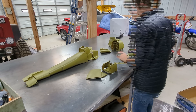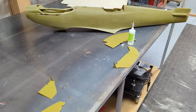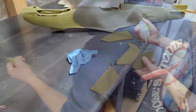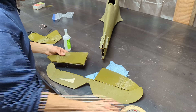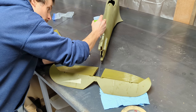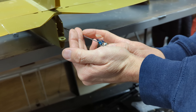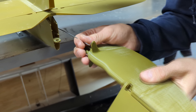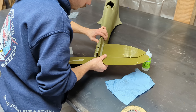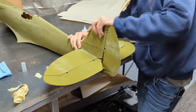Gluing all those pieces together is nothing spectacular, but the tail of the aircraft is a little bit tricky to get right. First, I glued all the control surfaces together. I used my flat shop table to make sure while the glue set, the pieces stayed aligned and as flat as possible. Getting the vertical and horizontal stabilizer installed is super annoying. This model utilizes 3D control rod tubes that are built into the prints of the fuselage. If you don't perfectly glue your fuselage sections together or your prints aren't perfect, your control rods won't go all the way through the printed tube. To fix this, I heated up the end of the control rod with a lighter and pushed it through the tubes to clear any problem areas. The control horns are also printed on the elevator and rudder, and since you have to install the elevator and horizontal stabilizer as one piece, you have to hook up the control rod first and then glue everything in place. Assembling the tail is a pain in the ass.